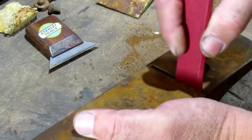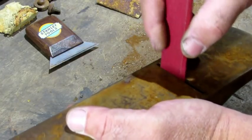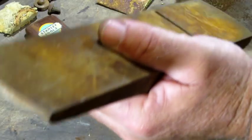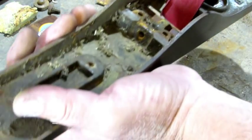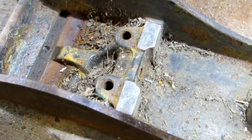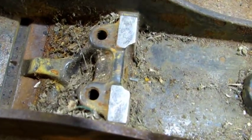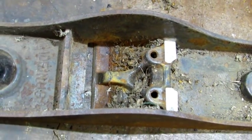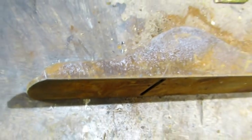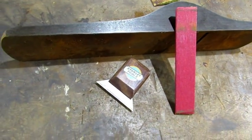The forward edge of the throat has a flat surface right there, so I can go around the throat and clean that up with my sanding stick. I don't want to mess with the edge that the iron's coming out of — just the forward edge. I can also come into it from the top side and do the same thing. Here's a closer look at what I was able to do with the sanding stick, and I've got a small brush I used on it too. That machine part right there is pretty much done except for some oil. So anywhere you've got flat machine metal surfaces, you can transform them with a fair amount of ease using your scraper and your sanding stick.